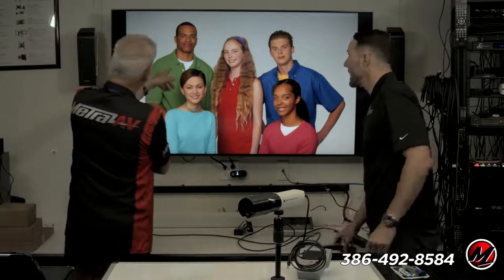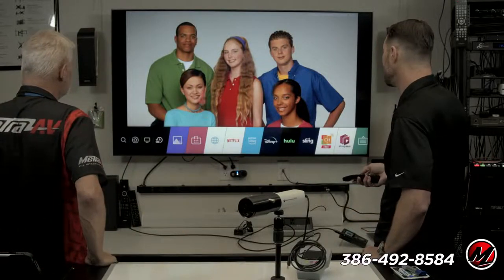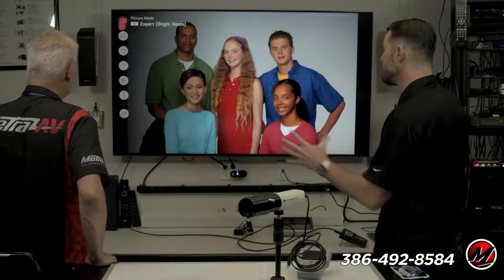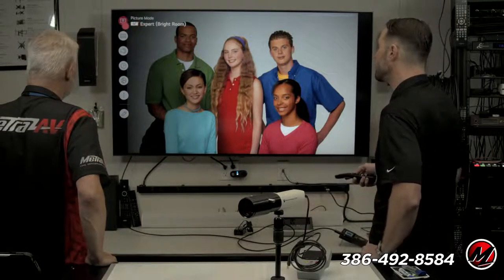Oh, he's orange. Right, so we got an orange guy over here, and I don't know if you can see it on camera, there's some wrinkles down here by her wrist. They're not all there. This guy's orange, everybody's orange. It's way oversaturated, it just looks silly, right? So you're looking at the test pattern, you're going, oh, cool, it looks so much more colorful. Then you look at actual content, and you go, oh my God, this looks ridiculous. So the color control is basically how much color is in the image.